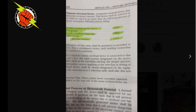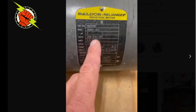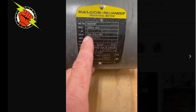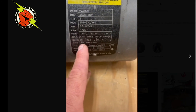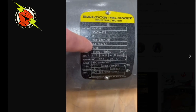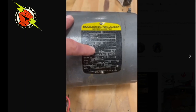To size the overloads, I use nameplate values only — not the values in the back tables. Looking at this nameplate, I've got a three-phase motor with 208, 230, and 460 volts, with corresponding amperage values. As voltage goes up, amperage goes down. I've got a service factor of 1.15 and a temperature rating of 40 degrees Celsius, so I take the nameplate amperage and multiply by 125 percent. If I'm hooking up 208 volts, I take 6.5 amps times 1.25 to get the amperage used to size these overloads.